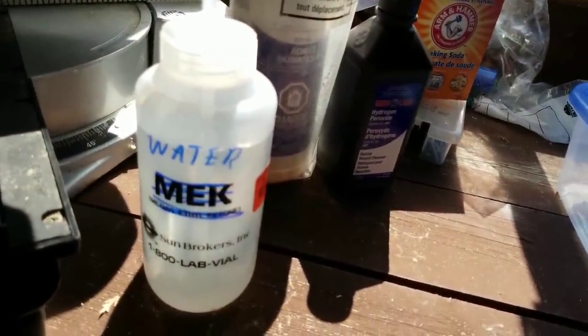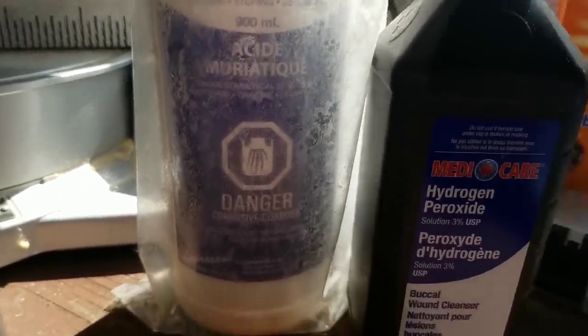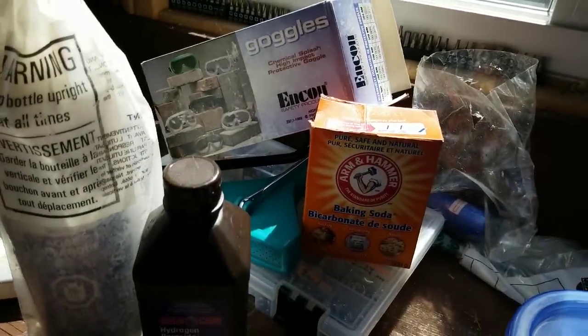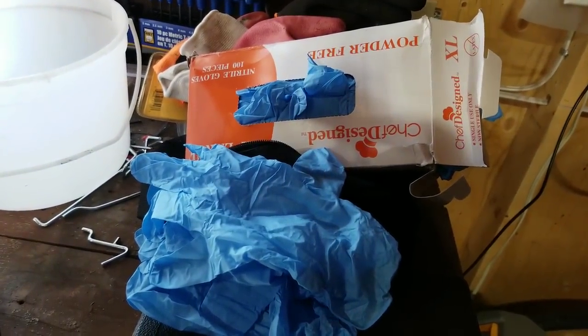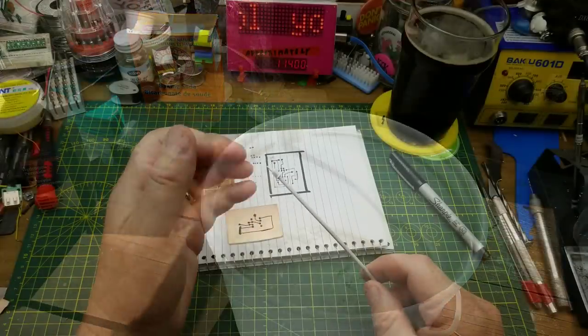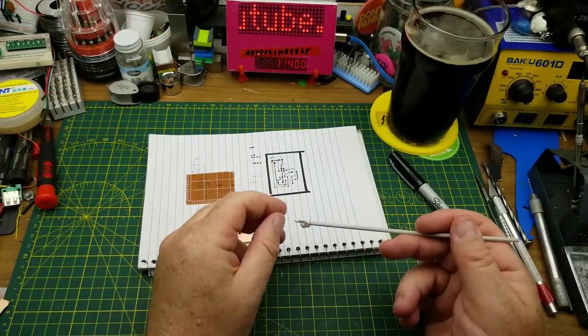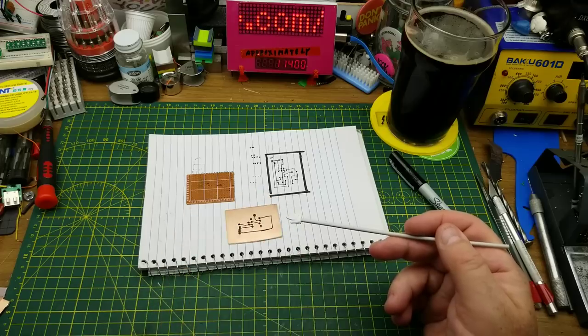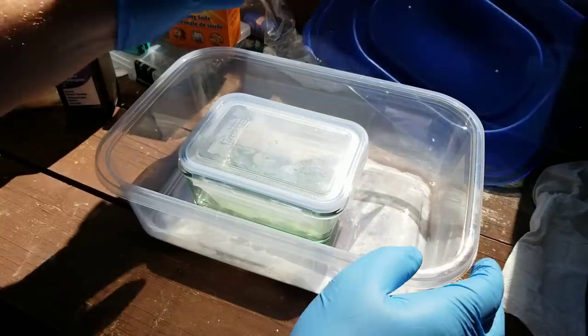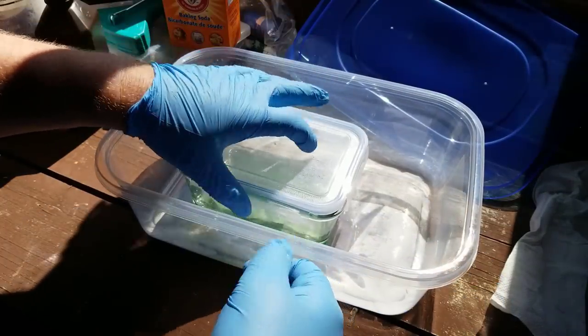Then I went out to the garage and set up my chemistry. I'm not going to give you the exact formula I used because I just pulled something off a random website, but back in the day I remember using the same chemistry when I couldn't get my hands on any ferric chloride — the only place that sold it was Radio Shack and they didn't even have it reliably. I found in one of the electronics magazines I subscribed to that you could use muriatic acid, easily obtained at the hardware store, plus hydrogen peroxide from the drugstore, and just mix them together in a certain ratio.